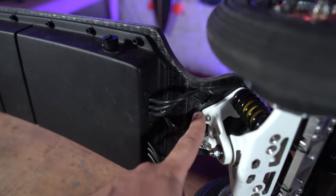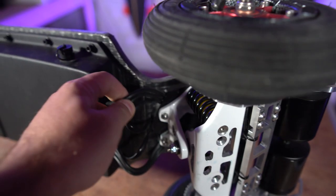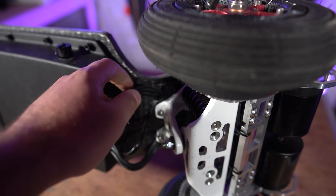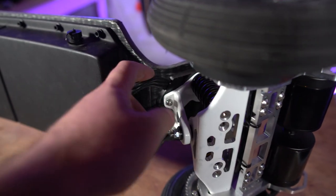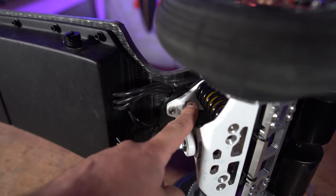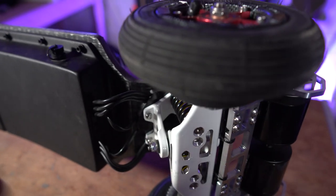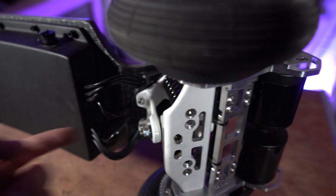The reason why is that we're actually using cable risers. So you'll see the cables going to there. These are terminated into MT60s. I think it's the flat three pin connector. Or is it MR60? MR60, I think it is, yeah. So you can unplug the motors quickly. The sensors are soldered together.